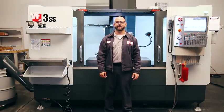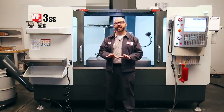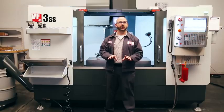Hello and welcome to this Haas Tip of the Day. What makes a G82 spot drilling cycle so special, different than a regular G81 drilling cycle, is its ability to dwell at the bottom of a hole.